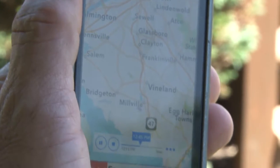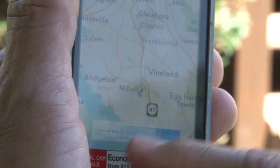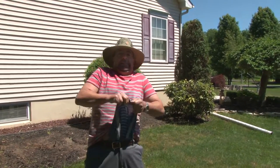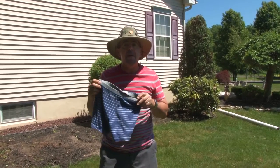Also, make sure that the temperature outside is between 60 and 80 degrees, that there's minimal wind, and no rain is in the forecast. Step 3: after the shutters are dry, use a clean cotton cloth to wipe down the shutters, because you're going to use an alcohol mixture and water to remove any residue. I always use items like this — they work really well and they don't leave any lint behind.